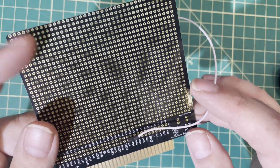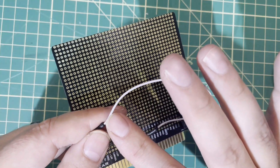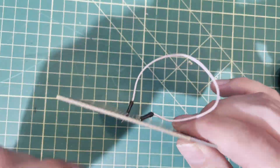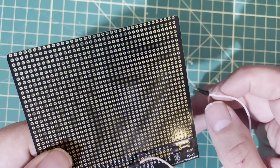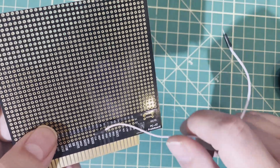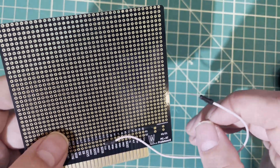Tip number sixteen: I use DuPont wires to connect directly to circuit boards and motherboards all the time. When you solder the thin wires inside these cables directly to a motherboard, they snap off when you move things around. But if you solder a DuPont wire, the stranded wire inside combined with the solid molded connection handles movement much better. So if I'm composite-modding an Atari, making a new cable connector for a keyboard to a motherboard, or any through-hole solder point, nine times out of ten I'm going to use a DuPont wire.